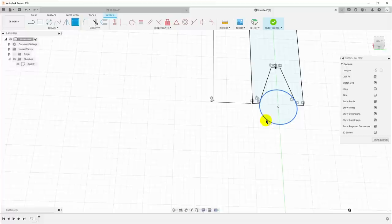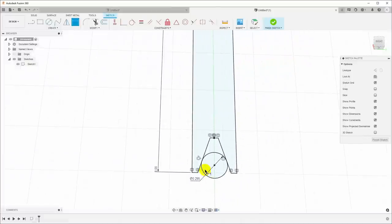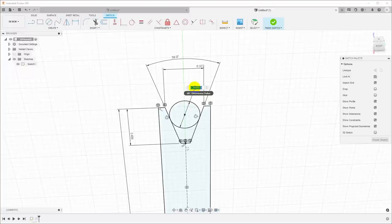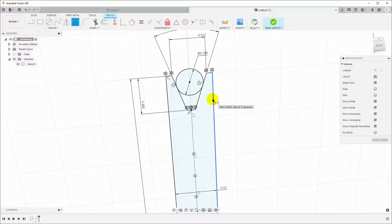We'll dimension these, we'll use the same diameter pins. We wouldn't have to, we could use any diameter pins that actually fit in the flat and make measuring practical, but for convenience, I'll pick the same ones, 295, 296, and now I'll take my dimension, right click, pick circle arc tangent,